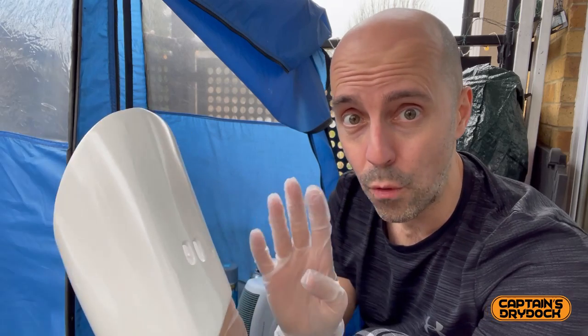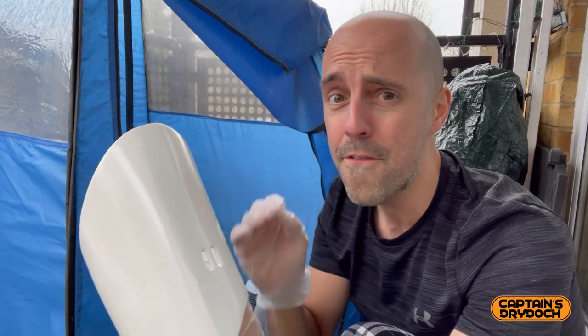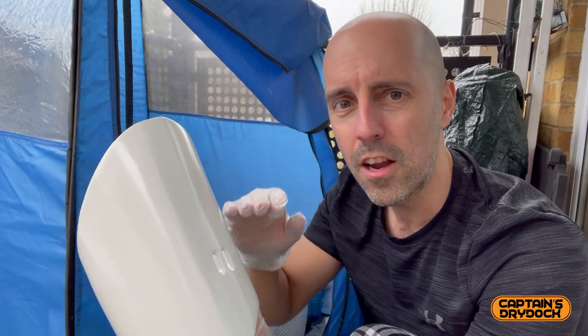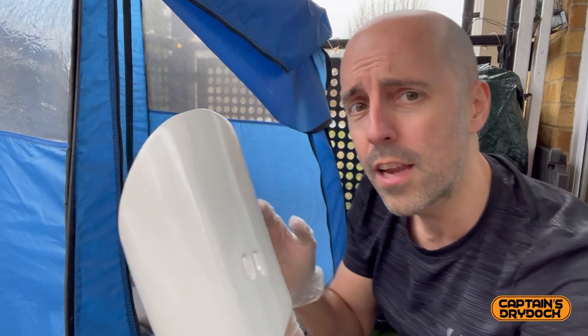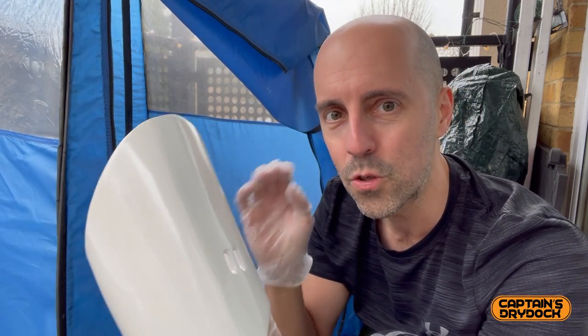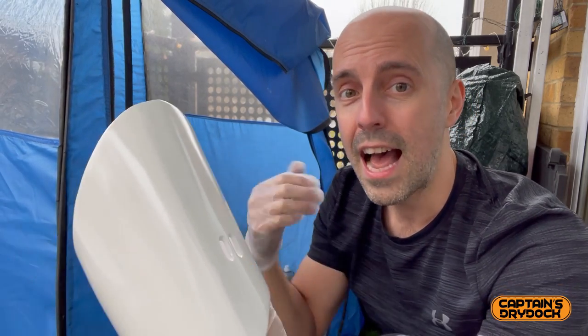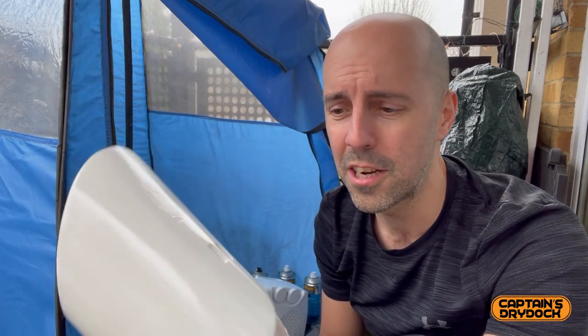The perils of gloss white paint. Bear in mind that I filled, sanded, and primed this four times, and even then when I thought it was perfect, it wasn't until I applied the gloss white that it started showing every different type of imperfection known to man — you can see the seam, the slight gradients from the filler. Now I'm not too hung up on little imperfections, but that's going to stand out like a sore thumb on a very large area, so that means sanding the localized area down, refilling, sanding, priming, and checking again. Luckily the other arm turned out great, so it's just this one.